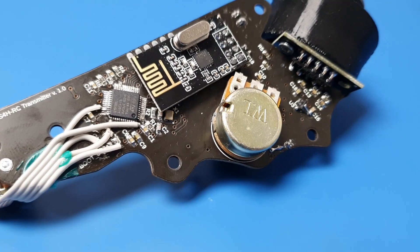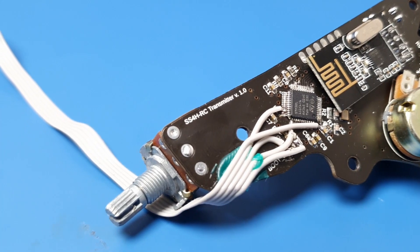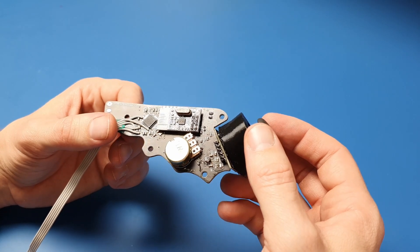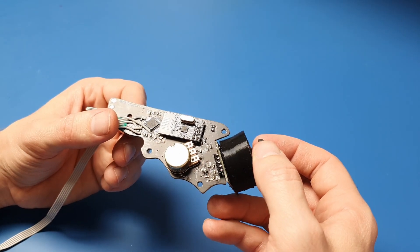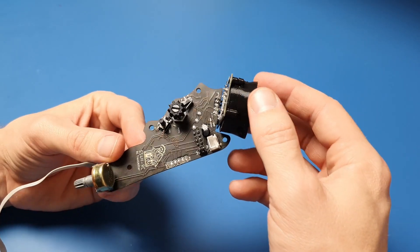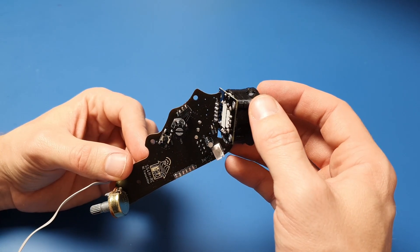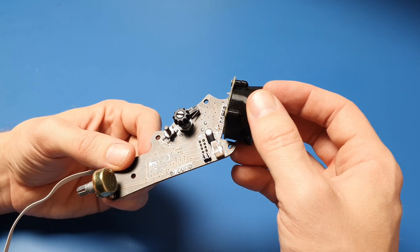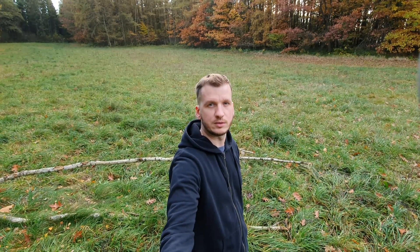And the biggest mistake of all — I forgot to add the connectors for the programmer. That's why I had to solder the wires directly to the microcontroller. Of course the PCB files you can download on my website are already fixed, so it'll work right out of the box. The NRF24 module is in the middle of the PCB and the antenna is close to the copper and other metal parts — I'm aware this will limit the range, but that was never my priority. I can use a module with an external antenna to improve range if needed. As for the actual range, I'm going to test it as soon as I assemble the whole thing and write the firmware.